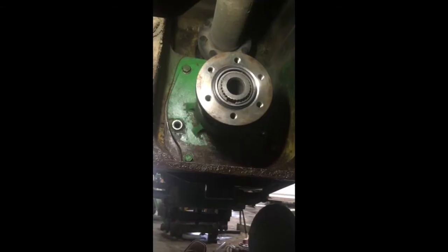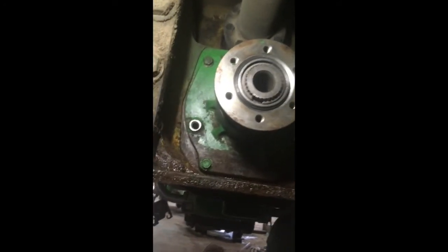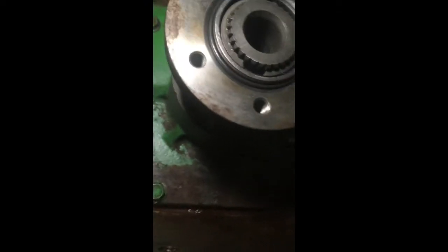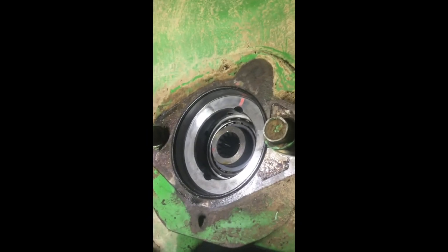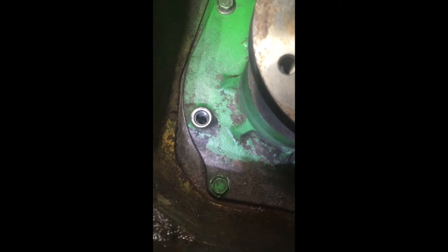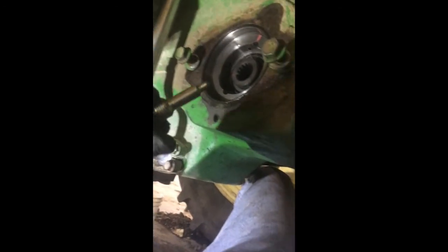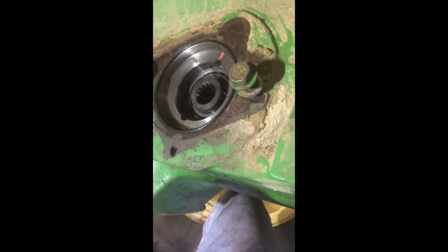Got the pump drive gear in — remember these two plugs that go in these holes here. You have to look into those holes with a flashlight. This gear for your pump — make sure it is turned to where you can get it on. There are slots and grooves right inside that hole; you have to make sure it's turned just so. If you marked it right you shouldn't have to worry, but double check so you don't run into trouble. These are little keepers that go straight in there and actually lock that ring to keep it from turning, so those bearings stay tight.